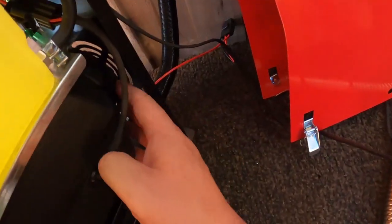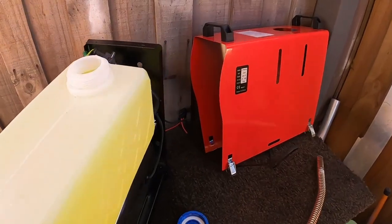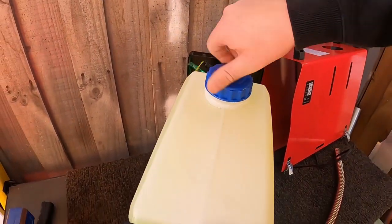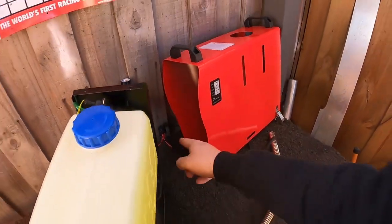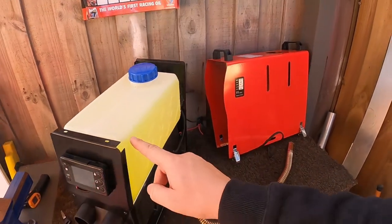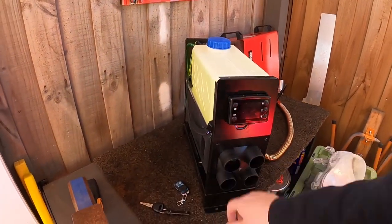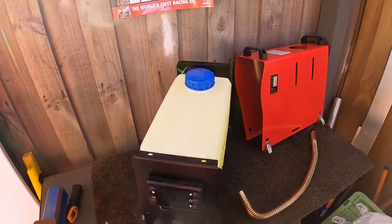And then down here is the motor. Fan at the back. Underneath here there's an intake. And then there's an exhaust which I've got to put on. It does need to be mounted a little bit higher off the ground. These little feet here — I'm going to have to mount them on some blocks of wood or something to lift it up off the ground. The good thing about it is it's 12 volt. You hook that up to a battery or a cigarette lighter plug. The diesel in here uses 100 ml per hour. So this is 4 or 5 litres — I think it was 5 litres. So you've got 50 hours worth of heating out of here at 5 kilowatts, which absolutely pumps. So I'll put it all back together, hook it up to a battery and fire it up, put the exhaust on, and we'll test it out.